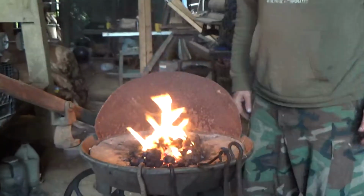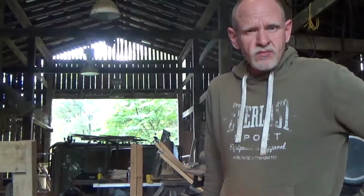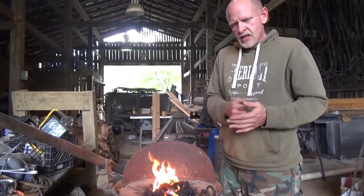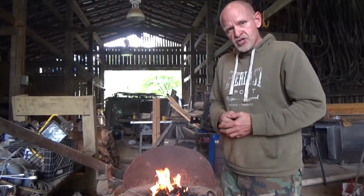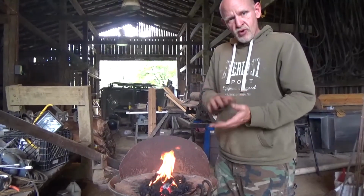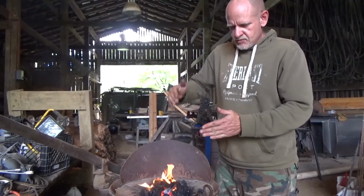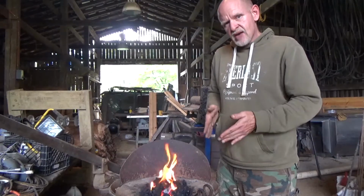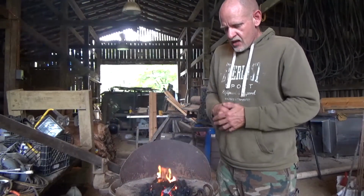Okay guys, I think this is a pretty good demonstration of being able to start a fire from scratch, to be able to set down raw coal that has not been started in a fire, basically from a flint and steel strike, catching a spark on a piece of char cloth, starting a bird's nest that we then utilize to start wood shavings. We have a pretty good amount of wood shavings to where we get a good fire started, and then we utilize charcoal to burn from there. We're basically setting ourselves up for success by putting the coal wet around the edges. We have our main fire base going, with enough going so that the coal has time to season all the way to a full coal fire.